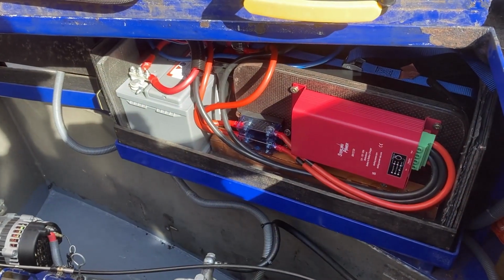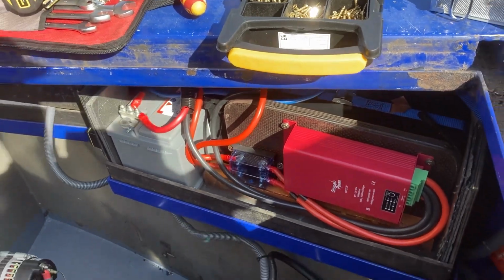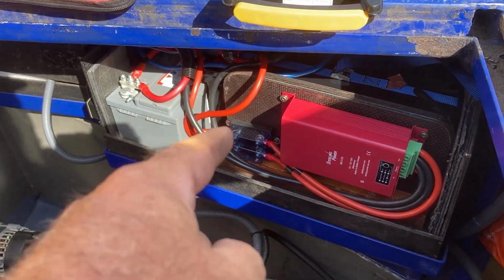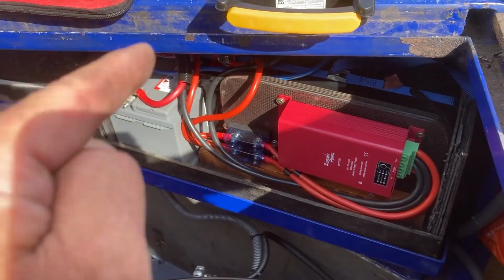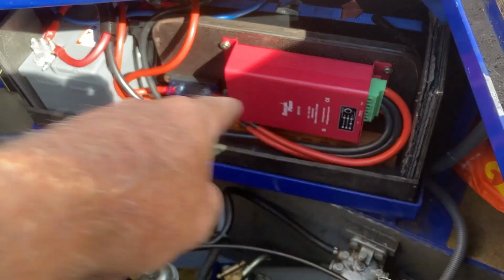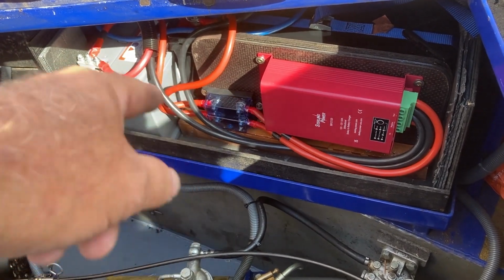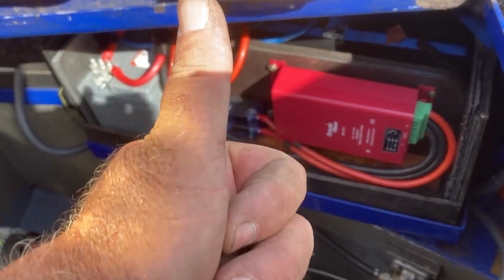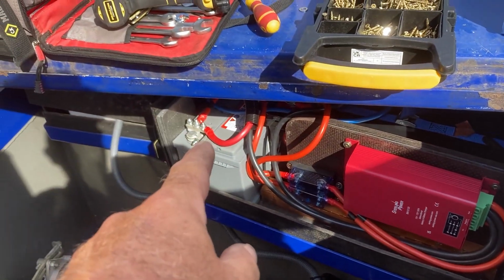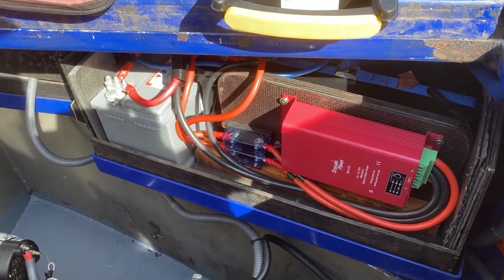Right, that's finished on the narrowboat Pura Vida. Did I get that right? Yeah. Okay, cool. The fuse is all screwed in, making sure that those screw points haven't gone through the buffalo board. So that block of wood that goes across is actually holding the batteries in place as well. They can't move anywhere, which is all good for boat safety. Two fuses, alternators all connected, all tested and working. So, yeah, happy days, really.